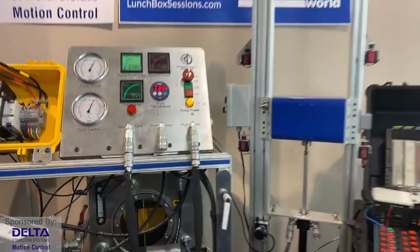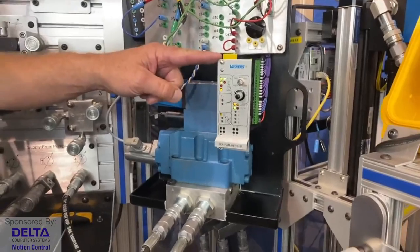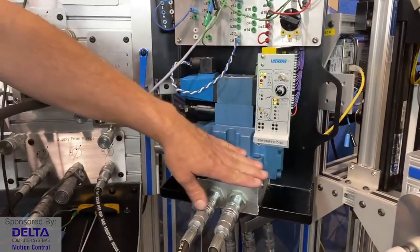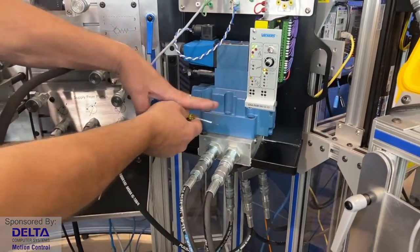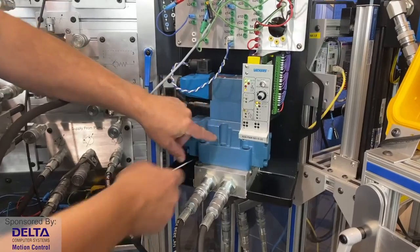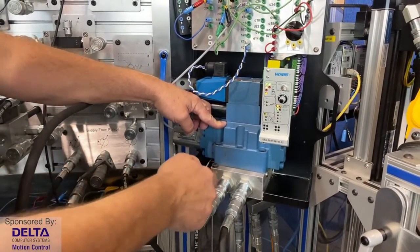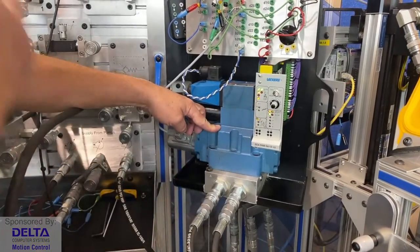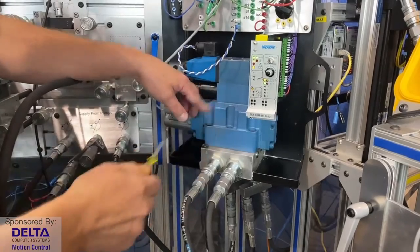So back over to the valve now and the controller, what we find out is that with such a large spool, maybe with the metering, if you're familiar with the V notches that are cut into a proportional spool, maybe we should only have moved that spool a tiny amount just to barely crack it open so that it wouldn't take so long to travel that valve closed again when we get close to the position we want.